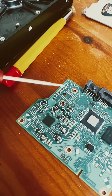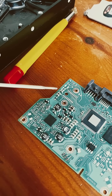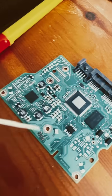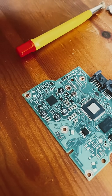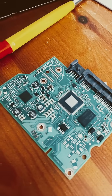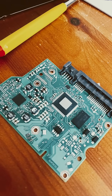These head connectors look quite clean but I'll give them a clean anyway. You can even put solder on them, but first I'd just clean them unless you know what you're doing. These ones are filthy — they definitely need doing, could be the reason why this board isn't starting up. I'll give it a clean and let's see if it works.